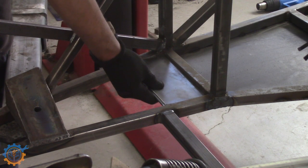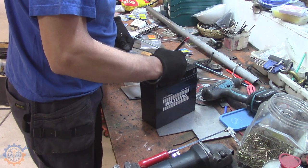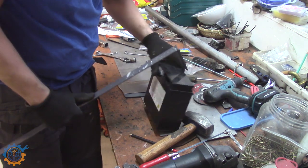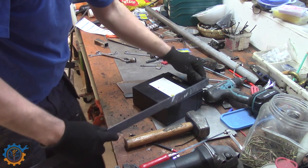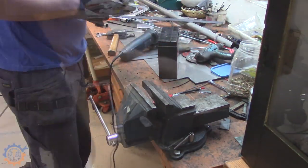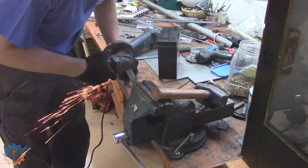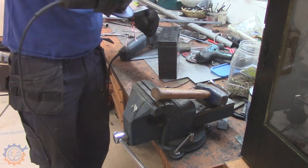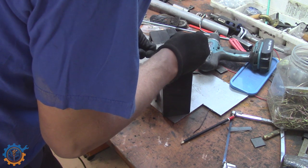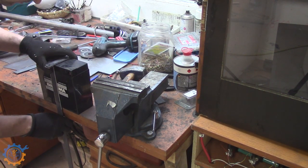When folded correctly it fits perfectly, and it does. Marking out the location of the battery and getting some pieces of angle iron, bending them into shape, and a test fit to make sure it fits as I want. Marking out the cutting location and cutting the bottom part off, making sure it is straight, and then another test fit. Grinding off all excess paint, making sure it is ready to be painted later on. Marking out the second piece, bending it into shape, and a quick test fit before cutting it off.